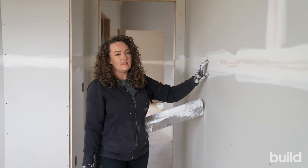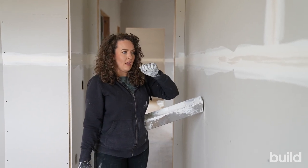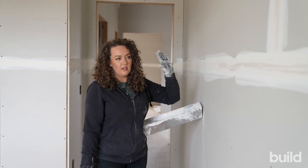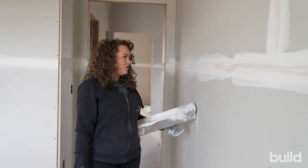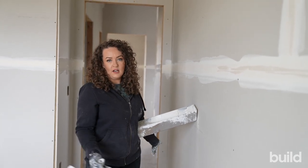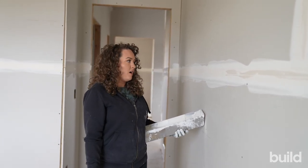If you were to coat this tape while it's still wet, it's going to have some major shrinkage going on and then also cause problems with your tape. So make sure everything dries, and then after it's dry, we don't sand before we start our first coat. We will sand between our second and third coat, but not with our first coat.